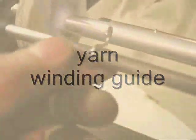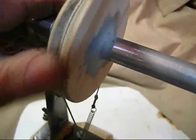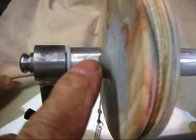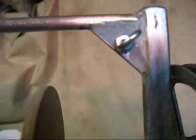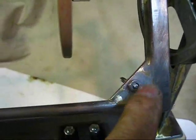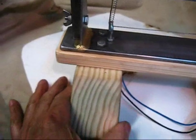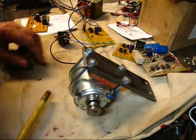This will have a rubber band on it — it works really good. The bobbin is just built-up construction; it does have aluminum center fillets on each side, epoxied. I did go ahead and put a Teflon bushing inside the aluminum — I may have to change that because it's just too slick. As you can see, I did add a gusset on the outriggers. I don't think they need them but it gave me a place to mount the eye bolt. It's quarter-by-two-inch steel plate.